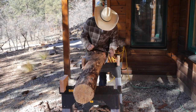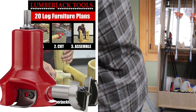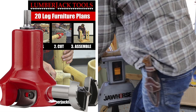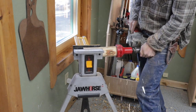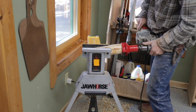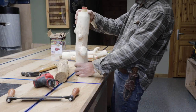After I get the bark pulled off, I ordered a Lumberjack tool inch-and-a-half tenonizer kit. It's a beginner kit and I'm glad I got it. One thing I learned is you can't use over three-inch size logs and you need to taper the ends. When I first started out, the tenons weren't very centered and the drill was jumping all over the place. What I learned is to take a grinder and grind the ends first — if it's not tapered it's hard to do. But if you look at the next one, I actually grinded the end and it went really easy. So you really need to grind the ends and then they come out really well. That was a learning curve.